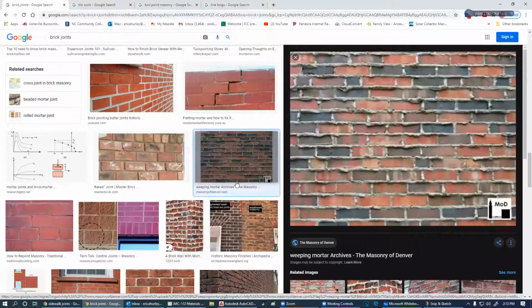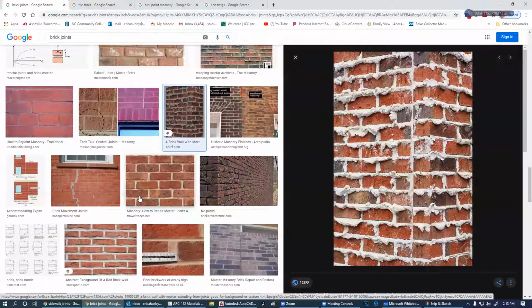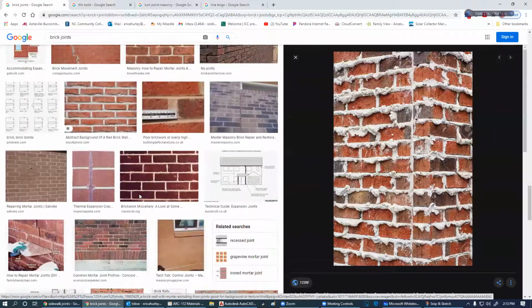That's what you see when you take down the wall around the chimney. There you go, that's exactly right. Or you take the CMU down without taking the veneer down first. Or I'll tell you where I've seen it, it's under my office. My office is on concrete or CMU piers, and then it has a brick curtain between them, and that's all over the inside of that thing. They just didn't care because it's not going to be seen.